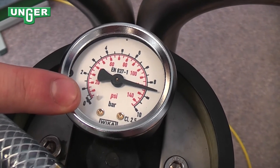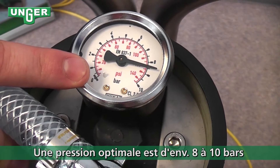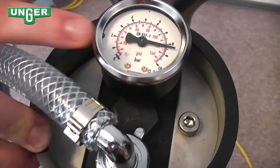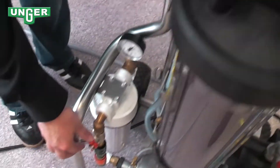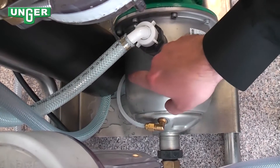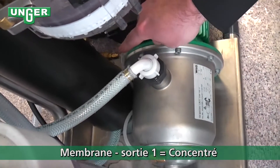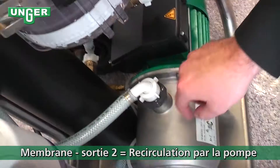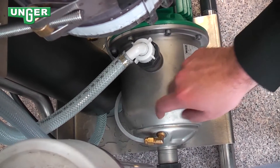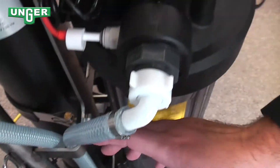Right now it's at 8.5 bar. Ideally, you want that to be between 8 and 10 bar. If the water pressure in the membrane goes over 10 bar, you can adjust that using the valve at the very beginning of the system. The water is then pressed through the membrane, and at the very bottom there are three hoses that come out. One is the concentrate that goes direct to the back. The second goes directly into the pump to be recirculated. The third is your clean water now coming out of the membrane and traveling up into your resin filter.